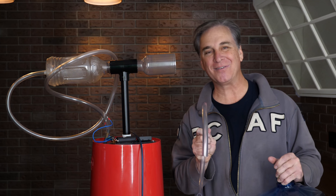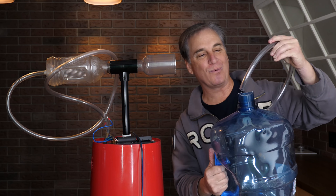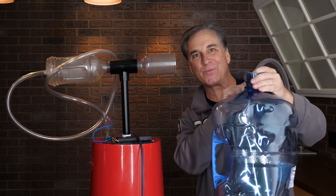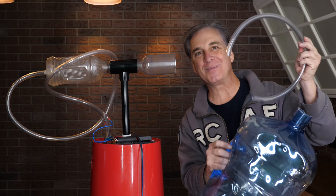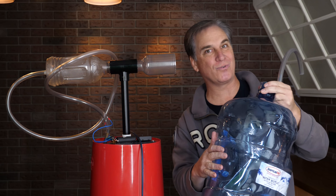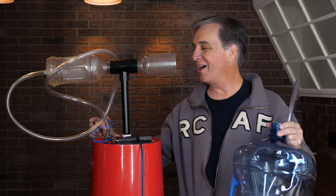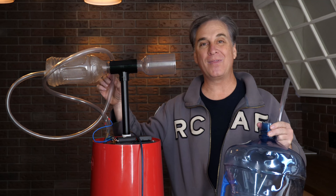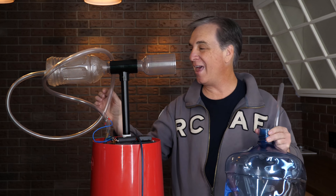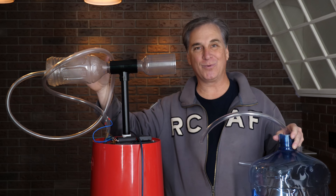So what went wrong? I had a short length of tubing going into our pressure vessel, and the spark was at the end of that tubing. When it was inside and we detonated the spark with gas flowing through the tube, all I ended up doing was creating an extension for my torch. The flame stayed sustained at the end, which will certainly destroy a plasma gun. That's why the different plasma guns have a long length of tubing. A super long length seems desirable, but then the spark doesn't reliably reach the ignition point, and a short length creates a sustained torch.